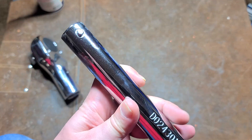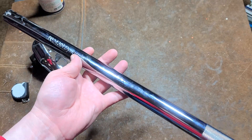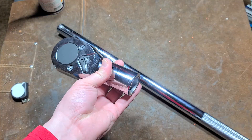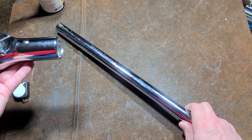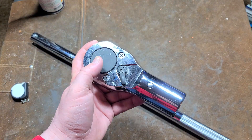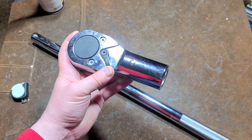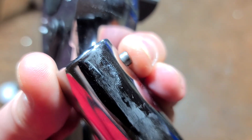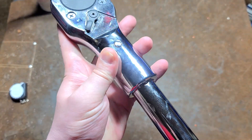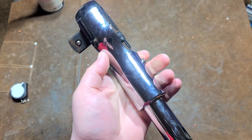We have a pretty decent-sized 27-millimeter or 1-and-1/16-inch handle. Overall length of the ratchet itself is about 26 inches from the head to the tip of the handle, or about 25 inches from the centerline of the anvil to the tip — about 63 centimeters. It is pretty heavy; it is a solid steel handle. One thing I appreciate is they don't use a ball detent — they use a pin detent which locks in, so when you put the handle in there, once it locks in, it's not going to slip or fall off.